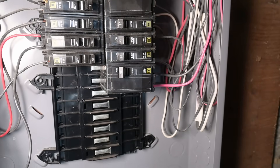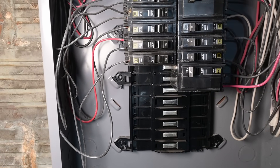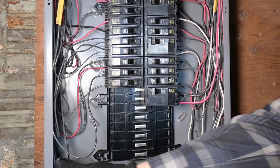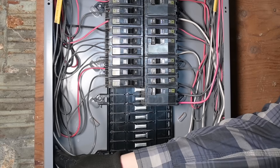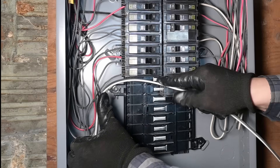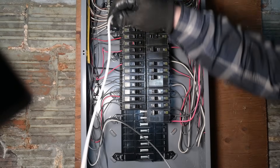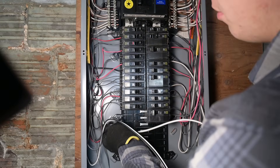You can see that drip loops were used in this panel previously — basically leaving a little bit of extra wire in case you need to move the breaker around. We're going to do the same thing, leaving a little drip loop coming down. We'll tuck our wires in right back here, bring it down to about the bottom of the bus bar — the lowest we'd ever really need to install this breaker — then bend it back up to exactly where the position of our breaker will be.